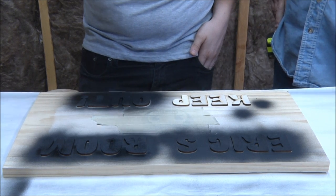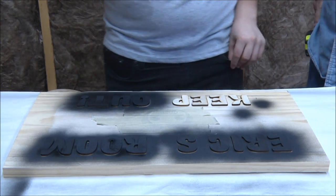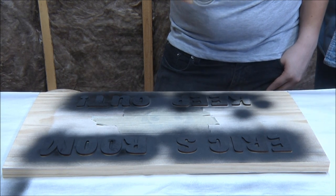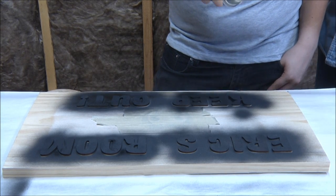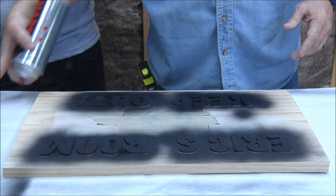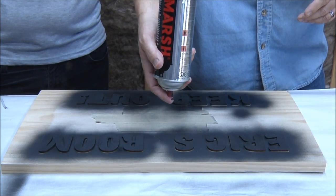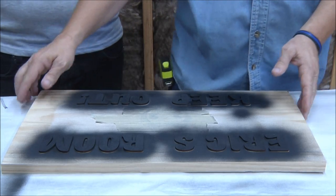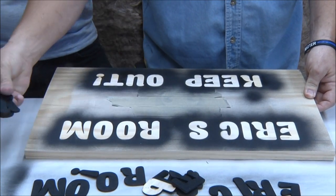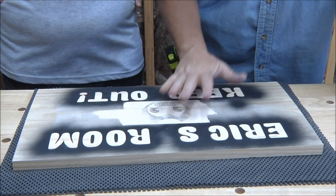Nice short little spurts — keep it moving. A lot of you guys have trouble with spray cans too, and I probably make it look easier just because I've been doing it for 40-something years. At the top you were getting a little heavy but that'll be good enough. Now turn the can upside down and clear the nozzle — spray for a few seconds till it comes out almost clear. That's going to give you a good line. A little heavy in a couple spots but overall, good job Eric.